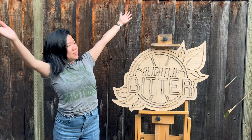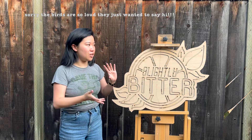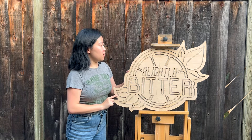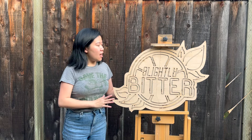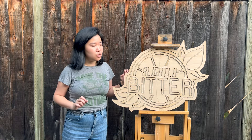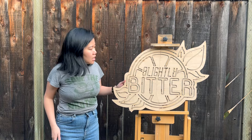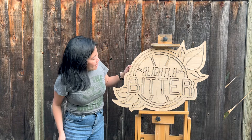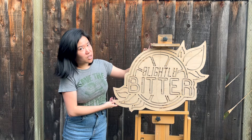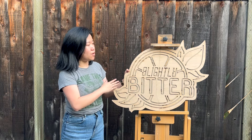It's been glued together and I was a little bit worried originally because the wood was so warped, and after I cut it, it warped almost even more because there wasn't as much wood to combat that bending. But weighing it down underneath all of our emergency water and wood gluing it all together, it worked out — the pieces fit together and it's nice and flat now. Next I want to first sand around the edges a little bit, clean up some holes that have wood glue in them so there's enough room for wire to go through, and smooth out some spots where the wood chipped off.